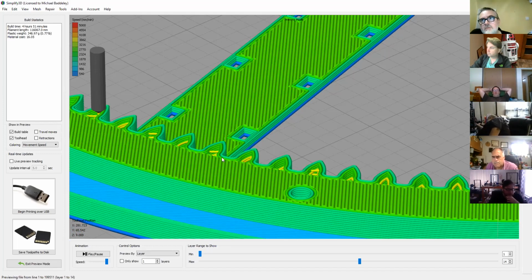I wonder, well, it's one or two things. It is either heat creep, which you can literally watch. How do you do that? Yeah, if you heat the nozzle up so that your cooling fan comes on, you can move the axis up and down and wobble the cable, and just make sure that the heat fan isn't switching off, which is a break in the cable. Have you replaced the cables at all on your S5? I have not, but it hasn't had very much use. Okay. I've always been very nervous about running 2 rolls of filament on like a 6-day print. Yeah. It's worth having a little play around with the cable just to make sure you've not got a break in the cable.